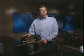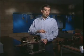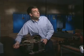The rotor of an induction motor can never actually reach synchronous speed, but at no load, it can come very close. If the motor were to turn at synchronous speed, the motor could not develop any torque.